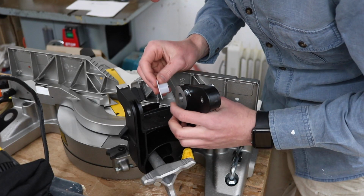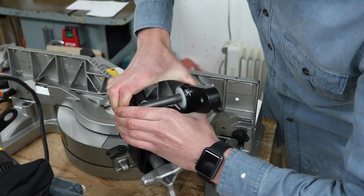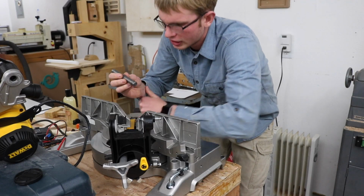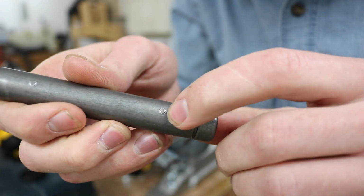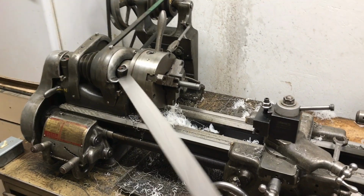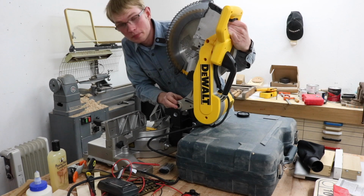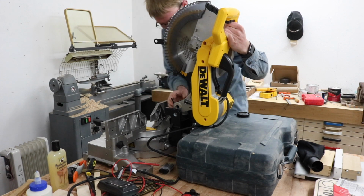All right, bushing number 5. Nice. I can still turn that one by hand, so that's gonna work. This should be ready to reassemble now, but I do want to try to remove that little welt that the set screw left. Otherwise that's going to damage the bushing when I put the shaft in. I'm just going to be filing this down, but the lathe is a good way to hold that while I do it. That should be good enough. Of course, the thickness of the flange on these bushings also mattered, but I think, yeah, that's going to fit.